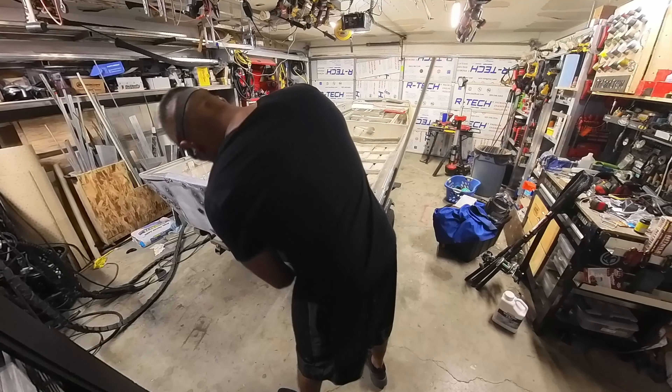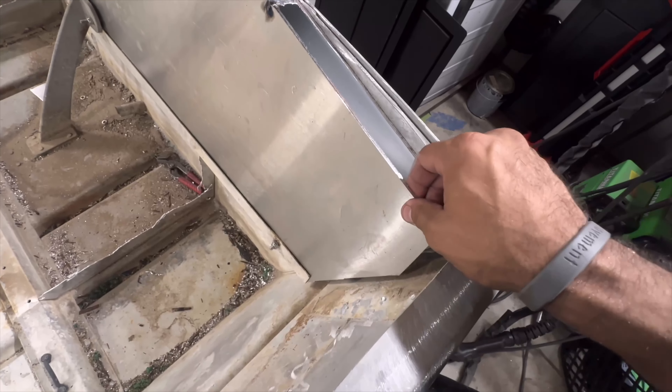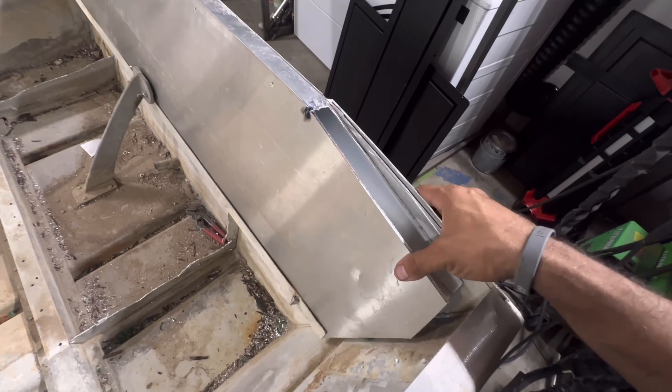The parts that looked like Swiss cheese were paper thin — every time I tried to weld even on the lowest setting, it just kept blowing through and the weld puddle kept getting bigger. I did my best and got around it, but those really problematic areas I'll probably be reinforcing with West Systems thickened marine epoxy, letting that cure, then covering it with a pretty thick coat of primer and Rust-Oleum oil-based enamel. Once it's coated properly it will not leak. When you do your cut spots you might have to re-rivet, which I'll have to do because I cut where the rivets would be.